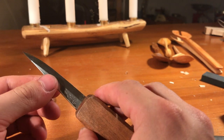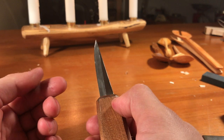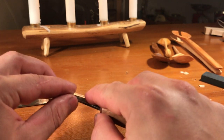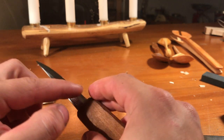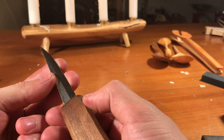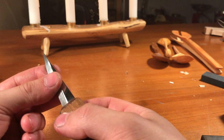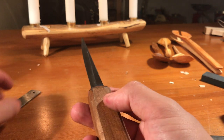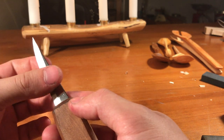First of all, the perfect way to do it is to go to a grinding stone like a Tormek or any grinding stone that you've got, and sharpen it on the grinding stone to create a concave surface on the edge and also on the other side symmetrically. If you cannot do that it doesn't matter, it's just a very convenient way to maintain your edges. Once you have done that you need to go to a perfectly flat sharpening stone.